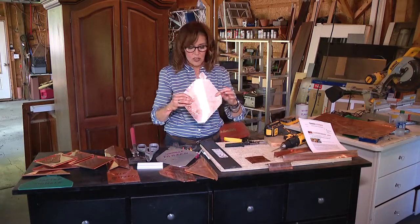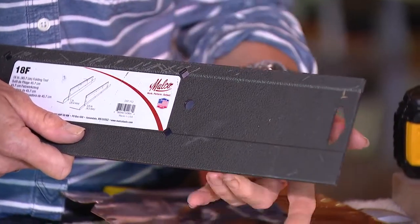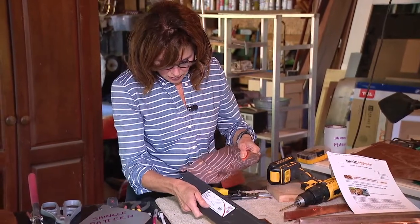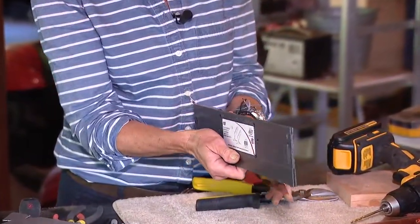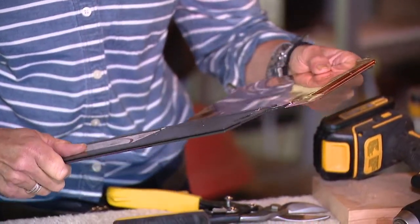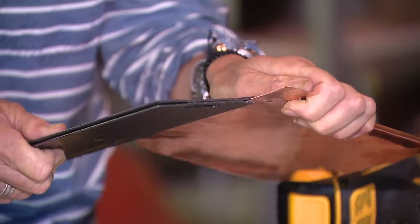There is my shingle. Now we're going to take this tool — this is an 18-inch folding tool. It has one edge that will fold 3/8 inch, and the other edge will fold 1 inch. We're going to use the 3/8 inch. I'm going to put my shingle in there and do it right there. Watch how easy this is. That puts the bend that we need in the shingle, and then we're going to go to the other side — same thing. So that's why it doesn't matter if our cut is super exact, because the fold is still going to be good. It'll give us a nice clean edge.